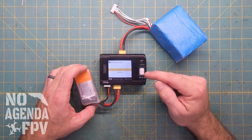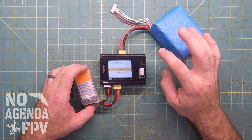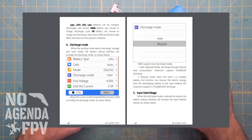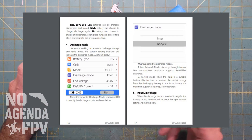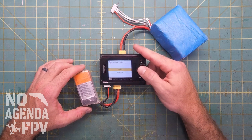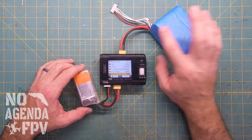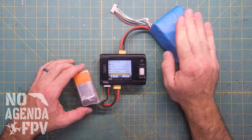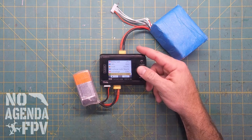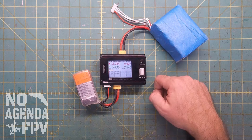The Toolkit video doesn't tell you how to get that option there — it just kind of assumes you already have it set up for battery. Not a great demo video. Even in the manual, which I'll link below, it just says to go to recycle without explaining how to get it to appear on screen. So now if I put it on recycle and set my discharge rating — this lithium ion is a 2P pack, so I'm comfortable discharging at 3 amps. If I go down to start, now you can see it's discharging at 3 amps.